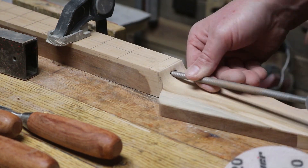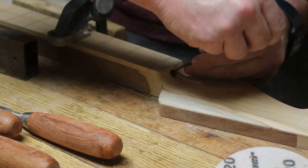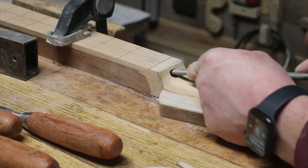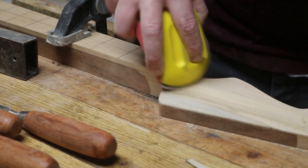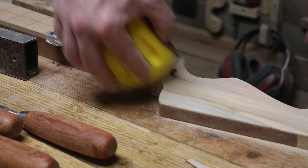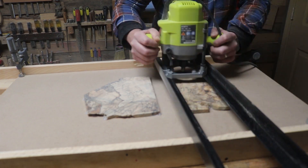I patch it with some CA glue, and instead of drilling out the little overlap I just file it in. I decided to oversize the truss rod access hole because the worst thing that could happen is that during a truss rod adjustment, if it's too low, you don't have clean access and you'll dent the headstock — and that's not what I'm about.